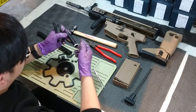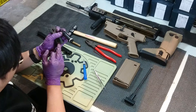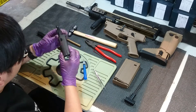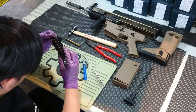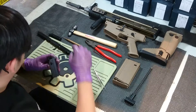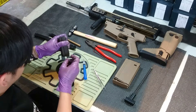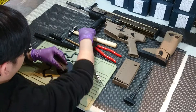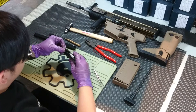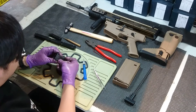Put the new nozzle inside and make sure the spring ring fits to the hole on the body. Thread it tight. Punch the main pin back into the body. Pull the nozzle and make sure your spring fits. Put the old nozzle guide back.